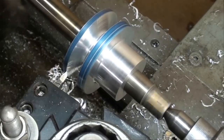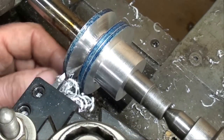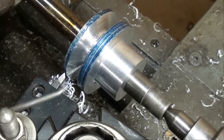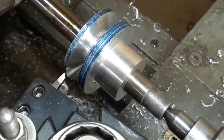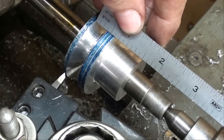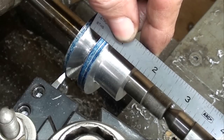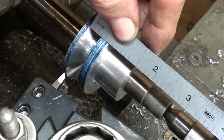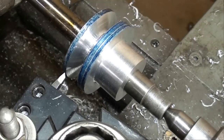In a way I'm facing only at a 15 degree angle. Use a hook like this to pull the chips out so you don't have to put your hand in there, at least when the machine is running. I'm just about up to my layout line — there isn't much left. When I flip it around, the half inch that shows up will bring us to a half inch of V-groove.